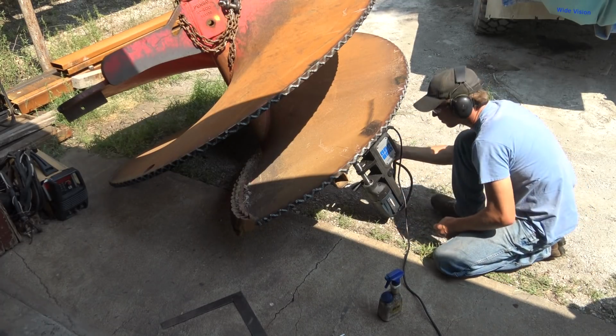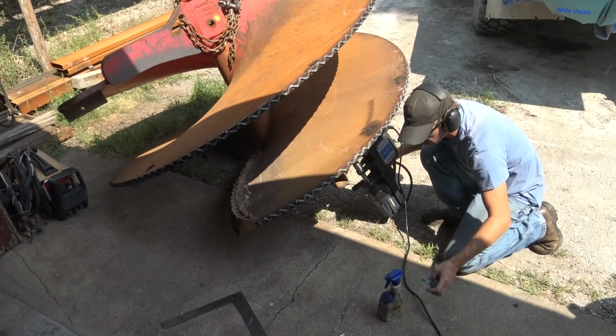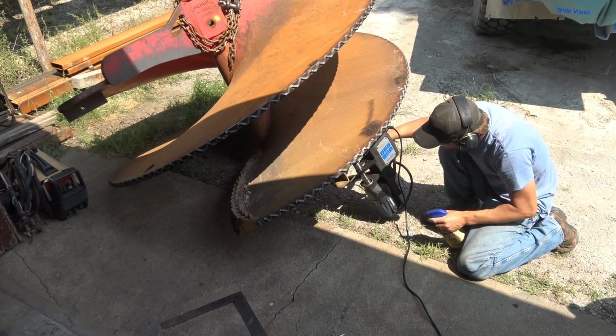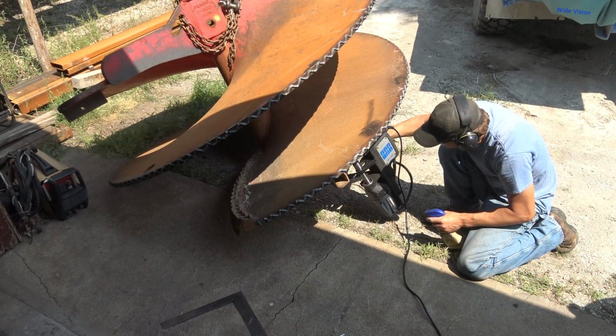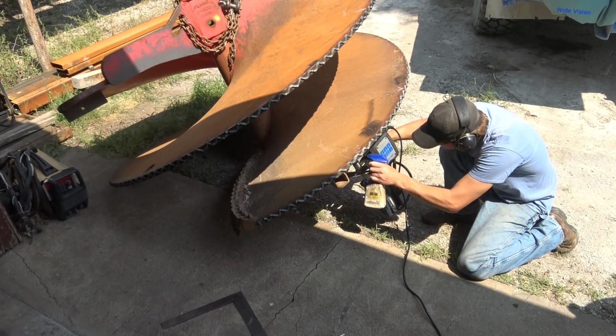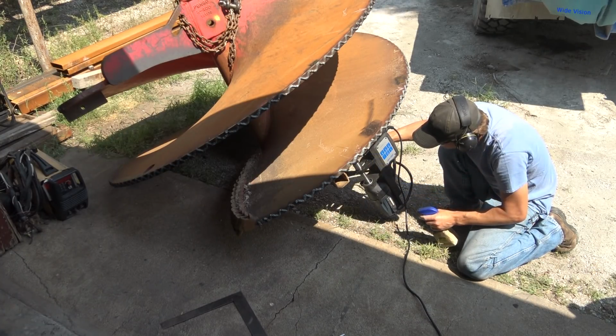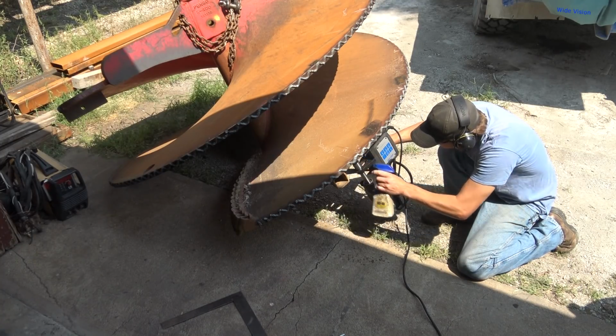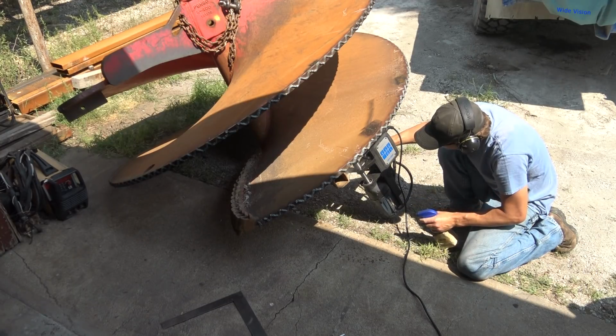And so I started all over figuring out where center was and did everything, and sure enough, they're not in the right place. They need to be exactly across from each other. I guess the best example would be a twist drill bit. If you've got one side longer than the other, not quite exactly straight across from each other like they're supposed to be, that drill bit's going to want to walk, make a different size hole, that kind of thing. Your pressure's not right. Same thing here. Probably even worse at this scale, I don't know.